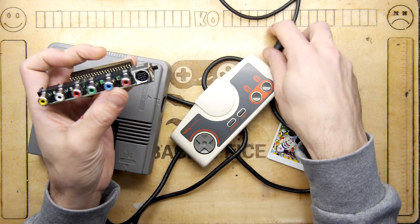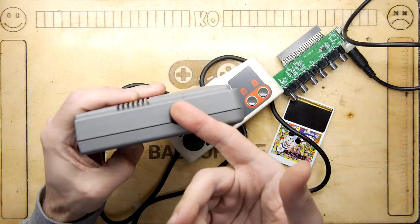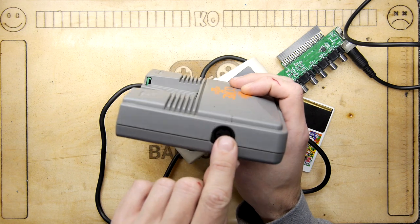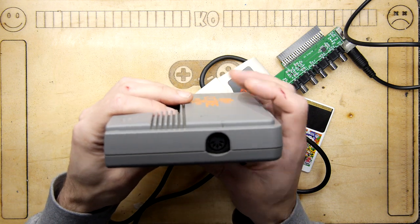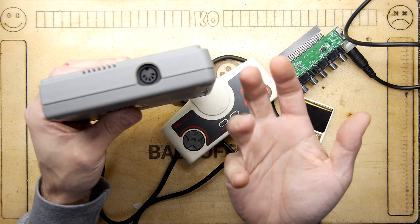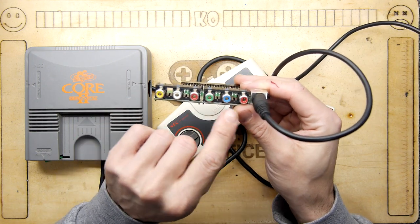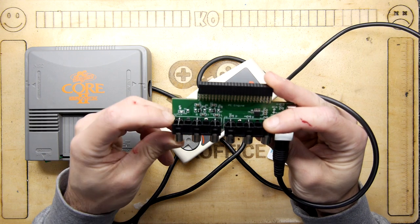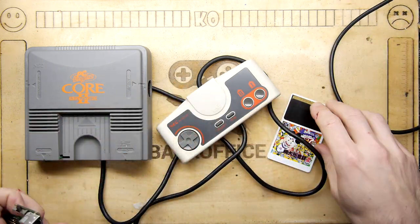What attracted me to it was that I already have a Mega Drive 2 plug that fits in there. You might wonder why I'm not using the AV port on the side — it's simple. You probably have those DIN connectors lying around from something like a Soviet ZX Spectrum clone. But those give you composite and stereo sound. I'm all about the RGB, and that's what this cable gives you: red, green, blue, audio, and sync.